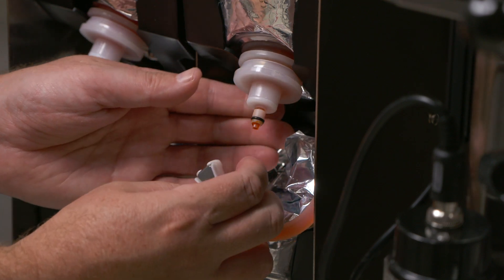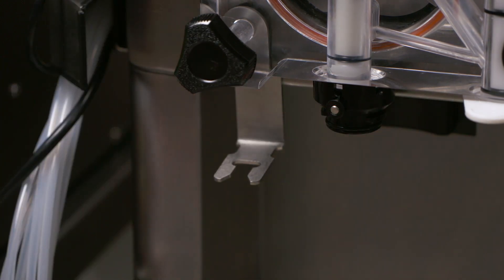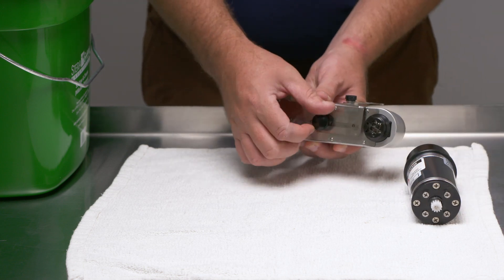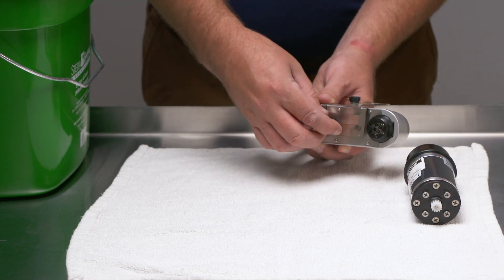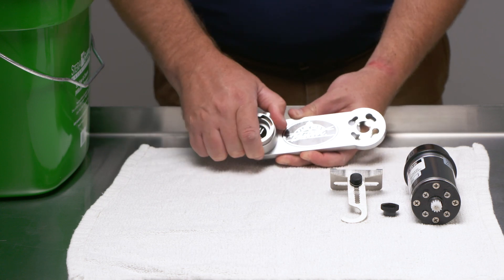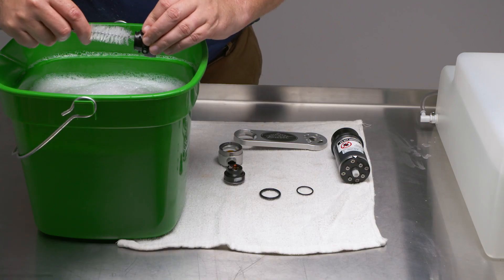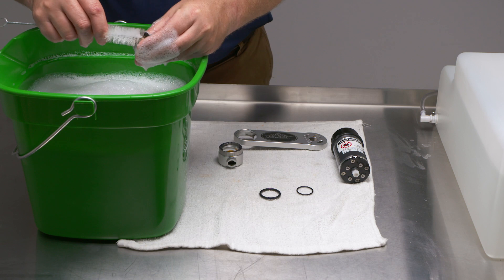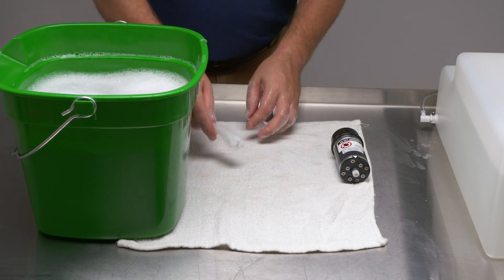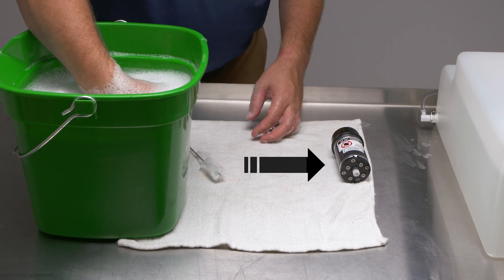Disconnect the syrup bag connectors from the syrup bag. Remove the blending assembly and adapter from the freezer and disassemble them. Submerge the blending head, gear cartridge, gearbox, nut, spout adapter, and O-rings in detergent water with the nine-tube assembly. Set aside the drive motor — this should not be soaked or exposed to excess water.